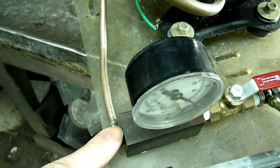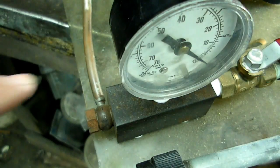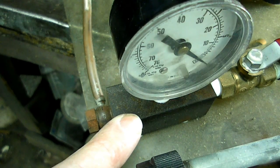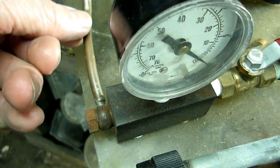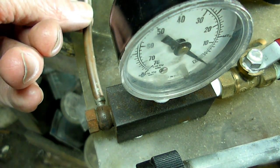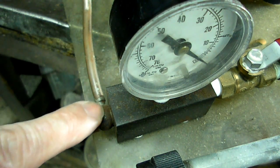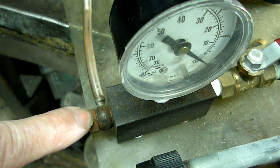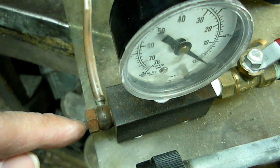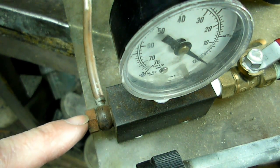I made this air manifold out of one that I had. If you don't have a way to make one, just Google 'air manifold' — they're pretty cheap. Now here's the line: it is quarter-inch. I used quarter-inch brass tubing. It comes down to this fitting, which happens to be a Volkswagen fuel injection fitting. I soldered that to the line, then drilled and tapped the manifold and used the bolt for it.